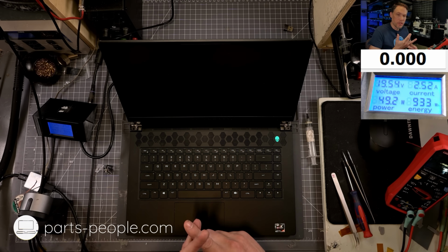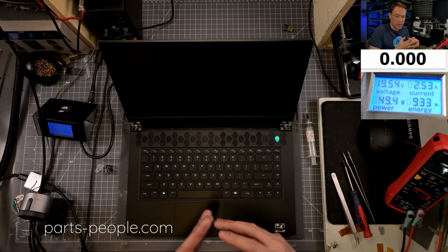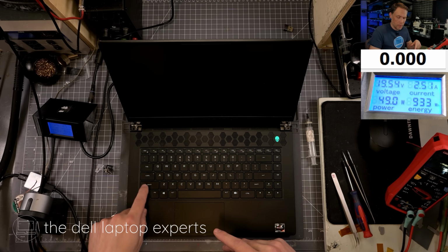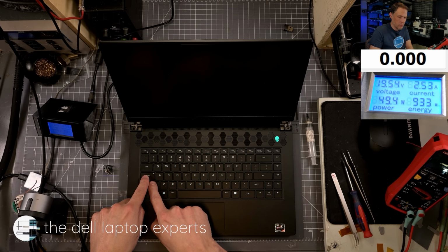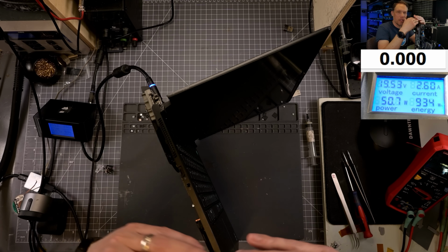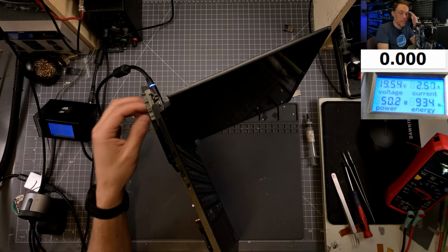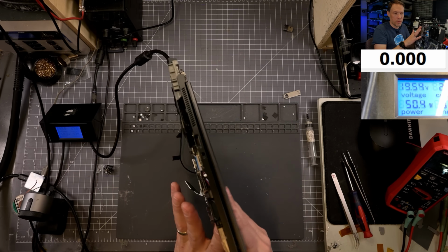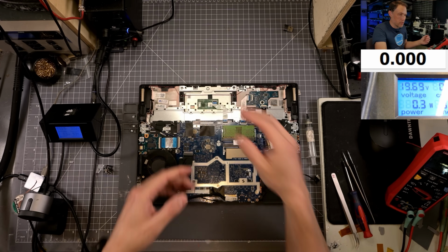You know, we could try a new LCD screen, but that connector definitely seemed like it's mangled. I could also check the fuses around there and see if they blew out a fuse. But the caps lock is running here. See if I apply a little bit of pressure. It doesn't seem like it's not connecting enough for it to work, so we may have a different issue on the motherboard now. Let's check the fuses real quick.